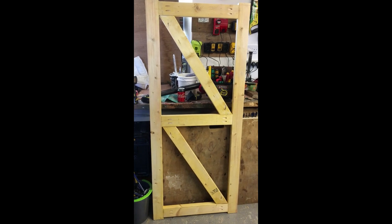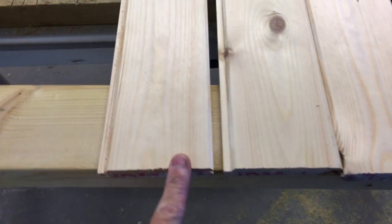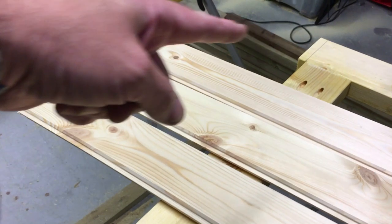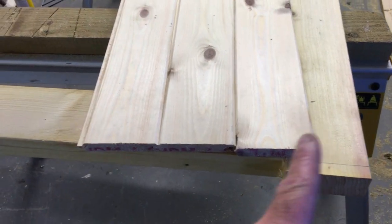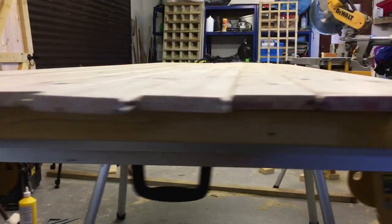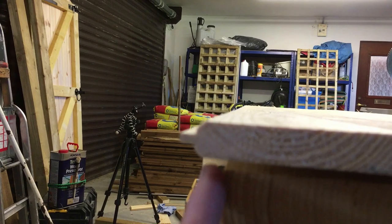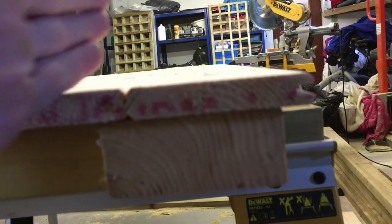This is the tongue and groove boards I'm using — this is match board, and you can see it slots together to give you a nice closed board design on the front. These are over length because we're going to be cutting a curve with a jigsaw out of the top once it's finished, and I'll leave them slightly over the sides to split the difference for width. We've got all the match boards roughly laid on the gate frame and we want to centralise them — there's roughly a 20mm overhang on each side, so that'll be fine.